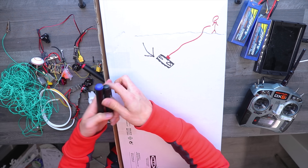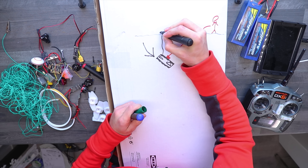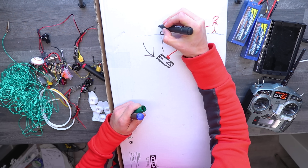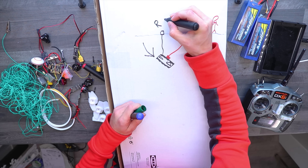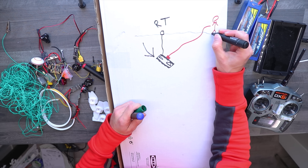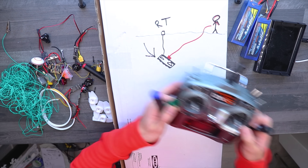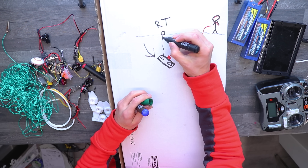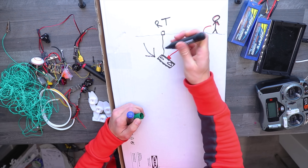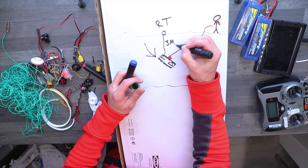Here's how we plan to do it. We're going to have the cable only go up to the surface. Here we have a little flotation device, and inside this box we'll have the receiver and we'll have the video transmitter that transmits the signal back to me, with the receiver and the handheld transmitter. That's the idea. This cable will only limit the depth we can go to the bottom of the surface. For this video, a 3-meter cable will totally work.